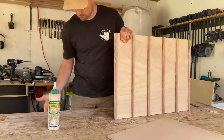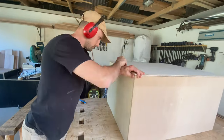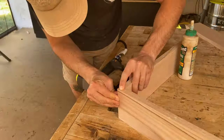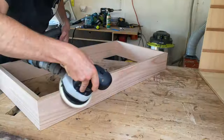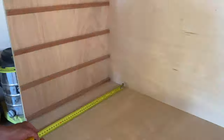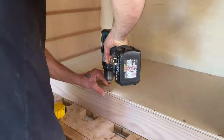Join your tops, sides, back and base using glue and nails. Cut your hardwood kicker and mitre the corners. Join with glue and 32mm brad nails. Sand your edges and corners smooth. Place the drawer carcass on top of your kicker, flush to the front. Measure, mark, countersink, pre-drill and join your carcass to the kicker using 30mm screws.